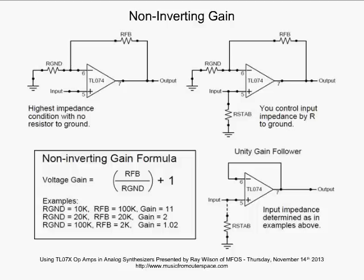But if you have a capacitor sitting here with no stabilization resistor, that current coming out of the non-inverting input or going into the non-inverting input can charge or discharge that capacitor. Your output of your op amp will start to ramp up or ramp down. Occasionally you'll find that it's not working at all, and you'll look at the output and it's at saturation voltage and you're wondering what's going on. It's because you don't have a stabilization resistor from that non-inverting input to ground, and that capacitor that's coupling the input to this input is charging up or discharging below ground. So keep that in mind. If you have a circuit you've built and you do have non-inverting inputs that are only connected to a capacitor and you have unusual behavior, look at that.